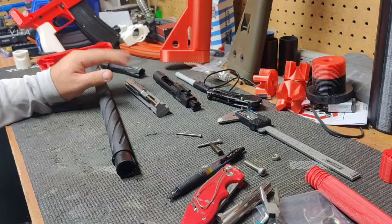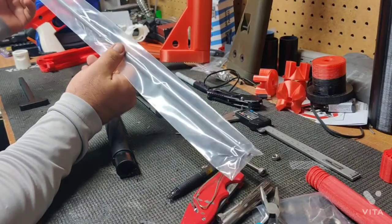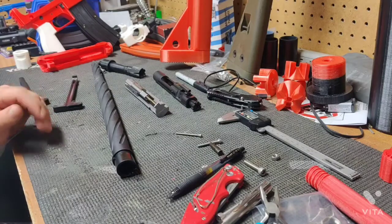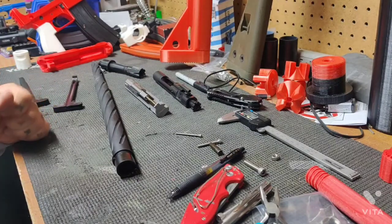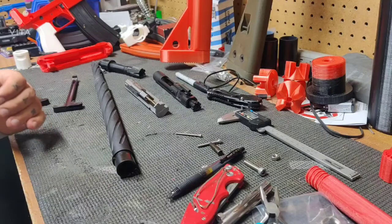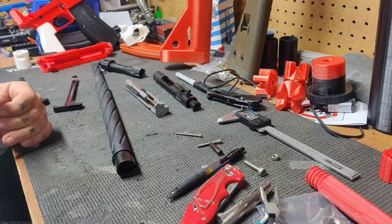The benefit of doing something like the 22 long rifle would be that maybe in the country you live in you cannot buy a barrel liner, like we can here in the states when they're in stock. One good thing about the 22 long rifle is that you can use quarter-inch brake line as a barrel liner. That would make it smoothbore — you're not going to have the same level of accuracy, and the walls of brake tubing are much thinner — but there are videos of people using brake line to successfully and repeatably fire 22 long rifle cartridges.